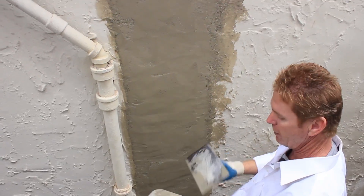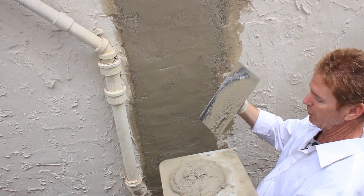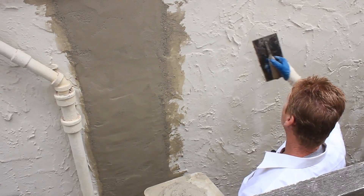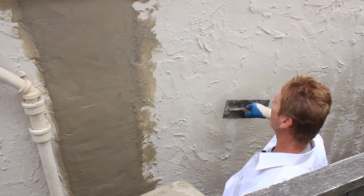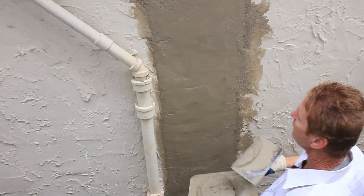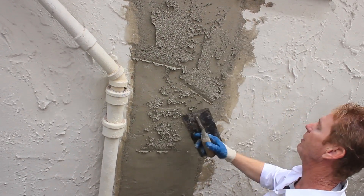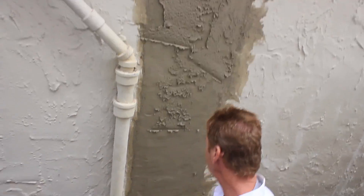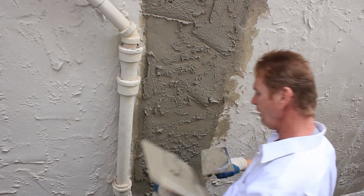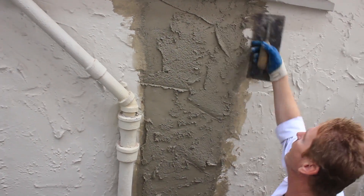The idea is you see these marks — that's a trowel mark, trowel mark, trowel mark — and it's a square trowel, because I see a couple areas where you can see that. What you do is just like that — it's like doing some of these Taco Bell finishes, heavy skip trowel. It doesn't look like a skip trowel, and you just let it fall, but that's all it is — just a heavy skip trowel, guys.